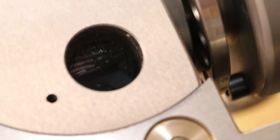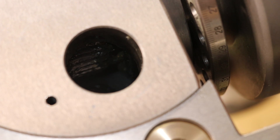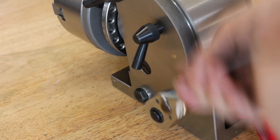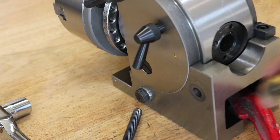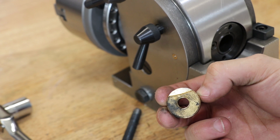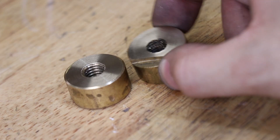In there is a bronze gear wheel — I wouldn't mind taking this apart and seeing how well it's made. As well as dividing, the dividing head also allows the work to be tilted, hence the marked angles on the side. To tilt it, all you have to do is undo these two bolts which loosen these two brass clamps. To be completely honest, these are some very roughly machined parts, so I gave them a very quick facing in the lathe and it really cleaned them up.